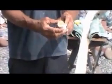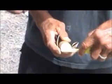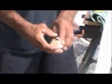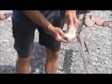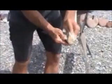What I use is a 1¼ inch dowel, as you can see there, 1¼ inches. I make a halfway mark so I know exactly what half of the cylinder is, and then I use it on here with some heavy grit sandpaper, and I make the chamber as I go down. A little time consuming, but that's all right, we're not in a hurry to make this thing.